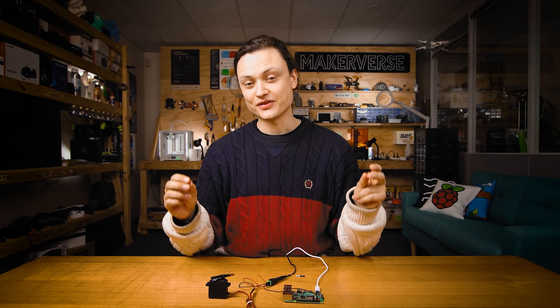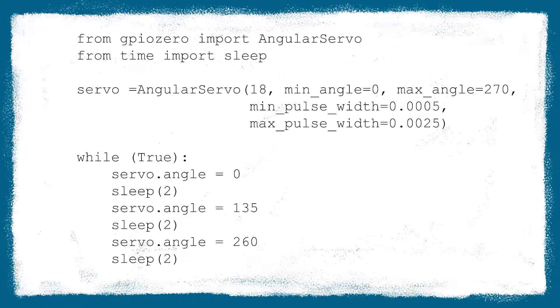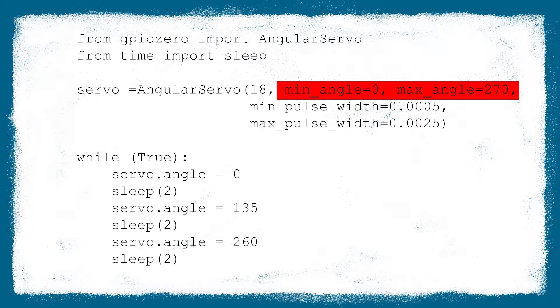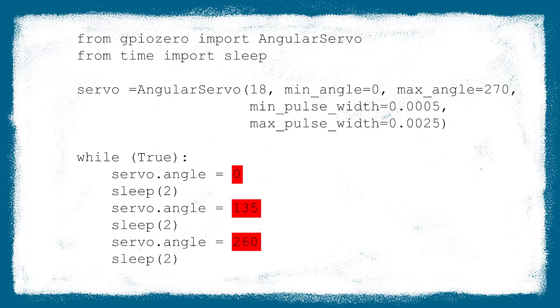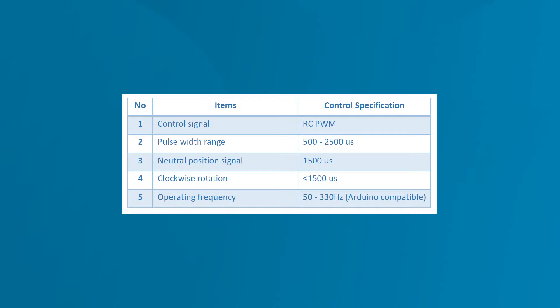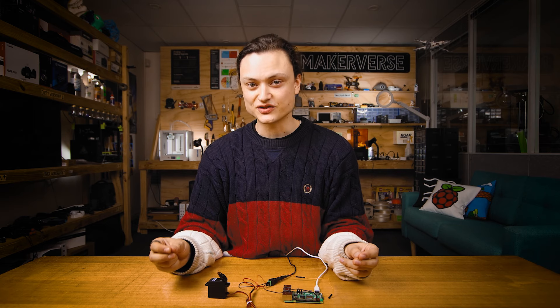Let's take a quick look at this code. The first thing to know is that it's very similar to before. Where this code is different is in dealing with the servo's higher range of movement — 270 degrees. We adjust for this in the line where we create the variable called servo and give it details using min angle and max angle. With those increased angles added, the code in the endless loop is also adjusted to accommodate this. The min and max pulse widths are also different for this servo. You can find a good pulse range by checking the data sheet and adjusting the values until full range of motion is achieved. You'll need to divide those numbers found in the data sheet by 1,000,000 to get the right size for the code.